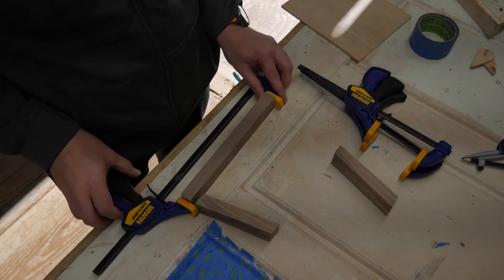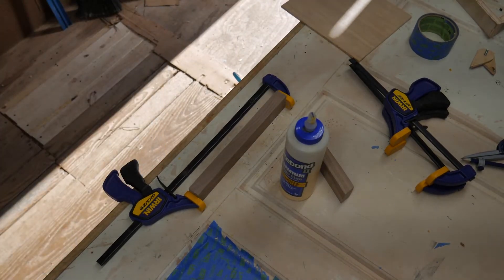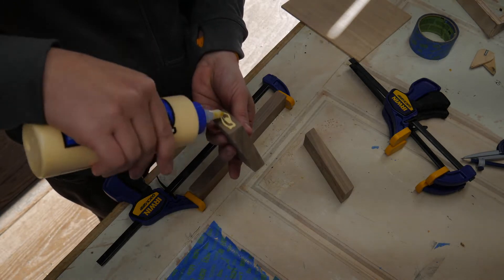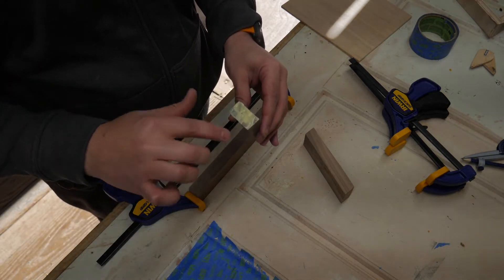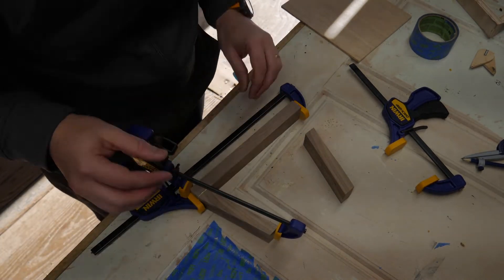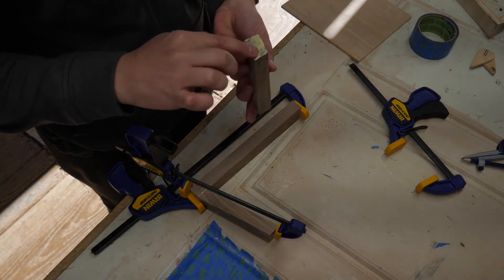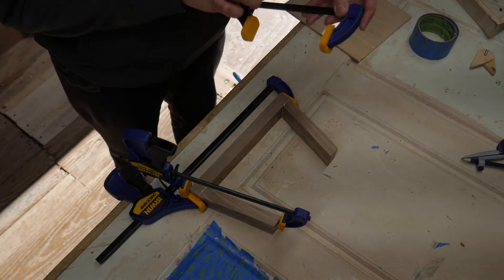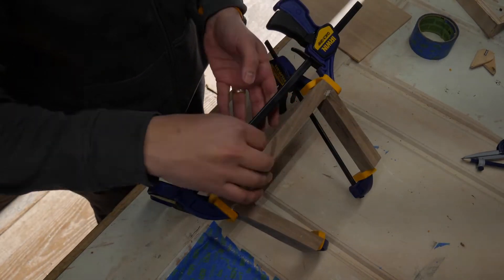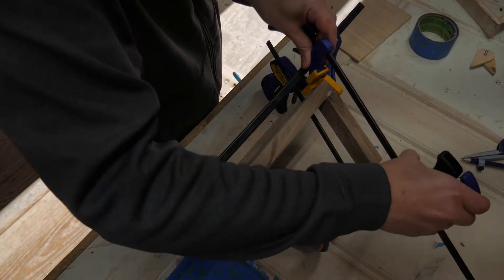I was trying to figure out how to get these to glue correctly because it's just an odd angle. What I did was put that first clamp at the bottom to hold the pieces in. I put a little glue — this is not a strong joint, it just has to stay together. Because of the side pressure of that original clamp, I'm able to clamp them in and pull them pretty tight. I ended up noticing some uneven glue squeeze out on the back, so I put two clamps back there as well to tighten everything up.